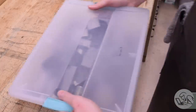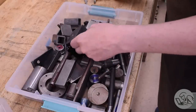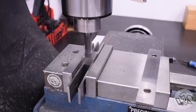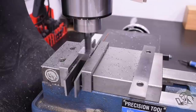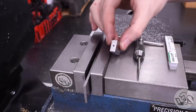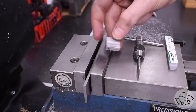Like so many days of my life, this one begins in the steel scrap bin. I need to make a fixture that's going to hold the shape of those column bearing structures while we do a whole bunch of operations on them. They're a bit of a delicate structure until they're complete, so we need something to hold them in place through a lot of machining, soldering, and other operations. This piece was squared up as accurately as I could, then I drilled some threaded holes in it to hold everything in place.